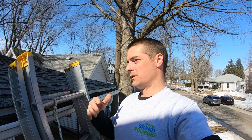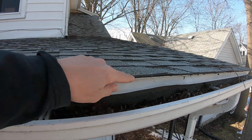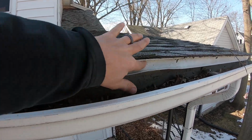That's where the issue comes in. If you're gonna roll it down over your fascia board, yeah, then I'll agree, it's better. If you roll it down in past your fascia board into your gutter, even better. But what you don't do is put it on your deck surface and not hang it over. If it walks or rolls back, wicks up under, it's gonna be on your ice, but it's gonna run back under your edge metal and soak in right to that bottom edge right here.